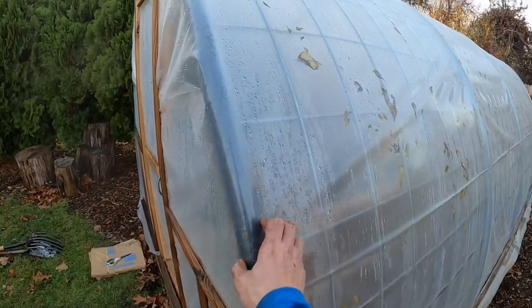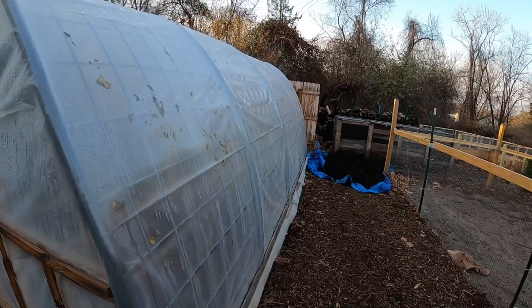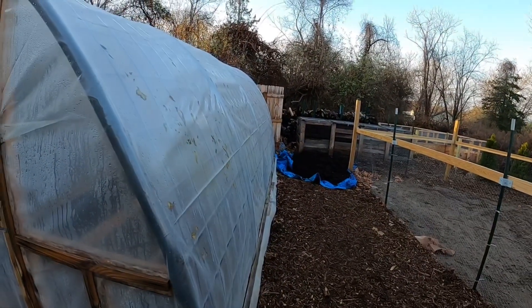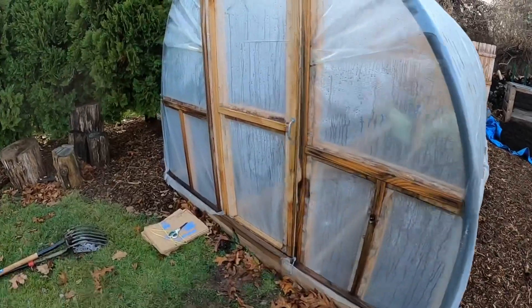You pull the tarp over, but you have to make sure you have the little foam pieces because at the edges of those cattle panels the bars aren't flush — they actually poke out, so they'll poke through your tarp. You need to have that foam protection. We just pinched the tarp in with a furring strip, pulled it over on the other side, and made use of it.